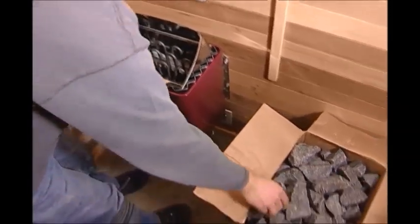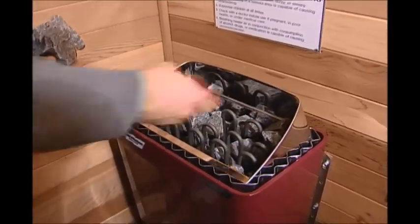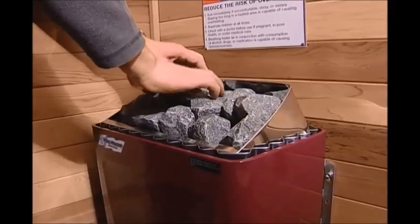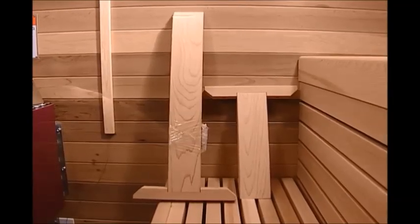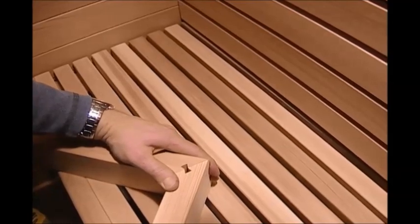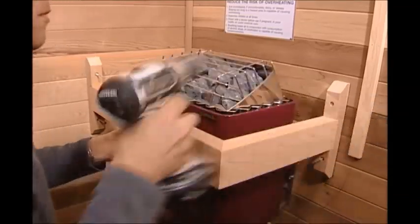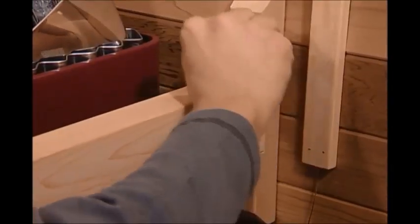Now place your sauna stones in the heater. The stones should be placed between the rows of elements. Use the smaller rocks between the elements and pile the larger ones on top — the elements should not be touching each other. When complete, most of the heater elements will not be visible. All of the stones may not be needed. Put the grill back on the heater and insert the screws. Wall heaters contain a two- or three-sided wooden heater guard. Line up the angled board so that the center hole makes a bow tie shape, insert the Hoffman locking key in the hole with the rounded side down, and use a hammer to drive the key in the hole. Line up the top of the heater guard close to the top of the heater casing, attach to the wall with 3-inch screws, and insert the wooden buttons into the holes.